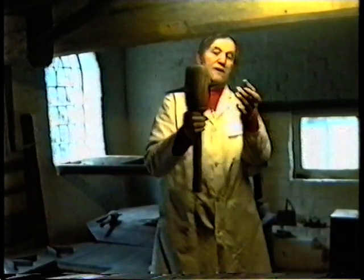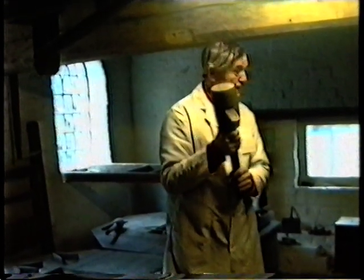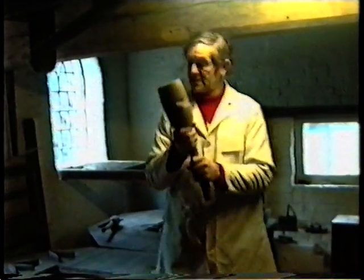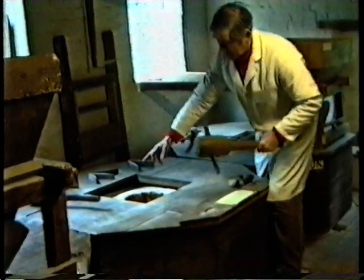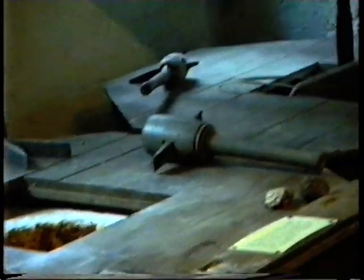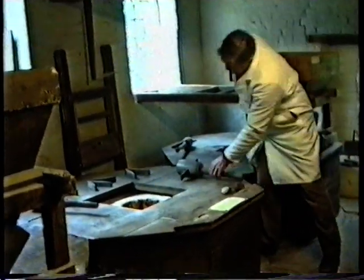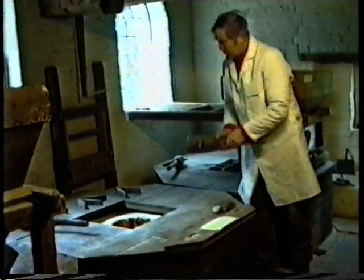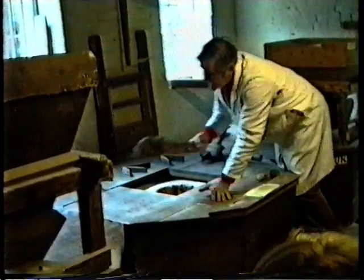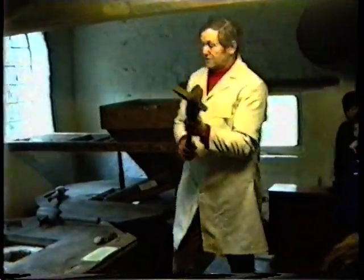It's called the thrift, and these metal things here are called bills. A bill means, like a bird pecks with its bill, doesn't it? Yes. So he does this to the stone. He cuts the lines. Imagine there's a stone and there's two in there. He does that. And he cuts the lines with that. But he has to turn the stones over to do it. Get rid of that modern device. Right. And we dress them with those. They're called thrift and bills. Once he's done that, to make it nice and fine, he takes a lighter one on smaller bills, and he sharpens them both ends, and he cuts his stones.